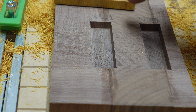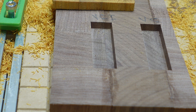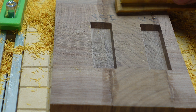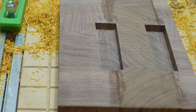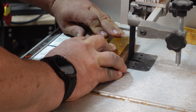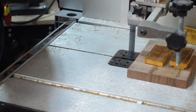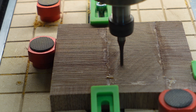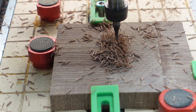Here we're going to fit our plugs to our pockets. First the v-carve inlay toolpath — you'll see that's a little bit loose. And now our normal v-carve toolpath — in this case that's actually kind of a tight fit. Then our final set of inlays: the normal v-carve toolpath using a six millimeter start depth and a 1.5 millimeter flat.